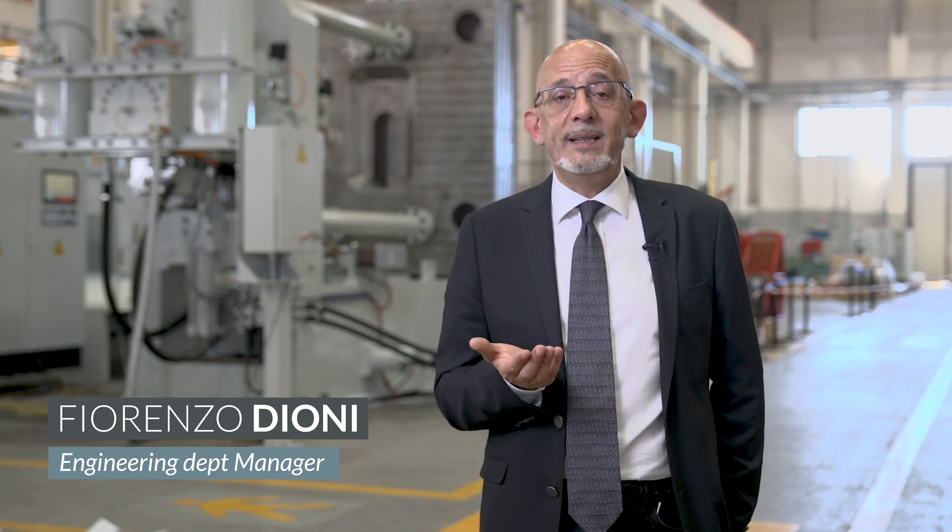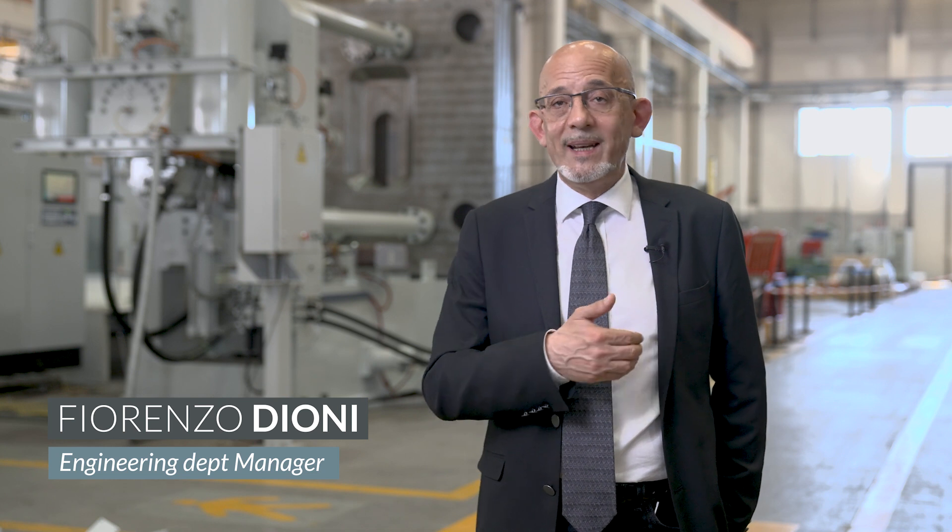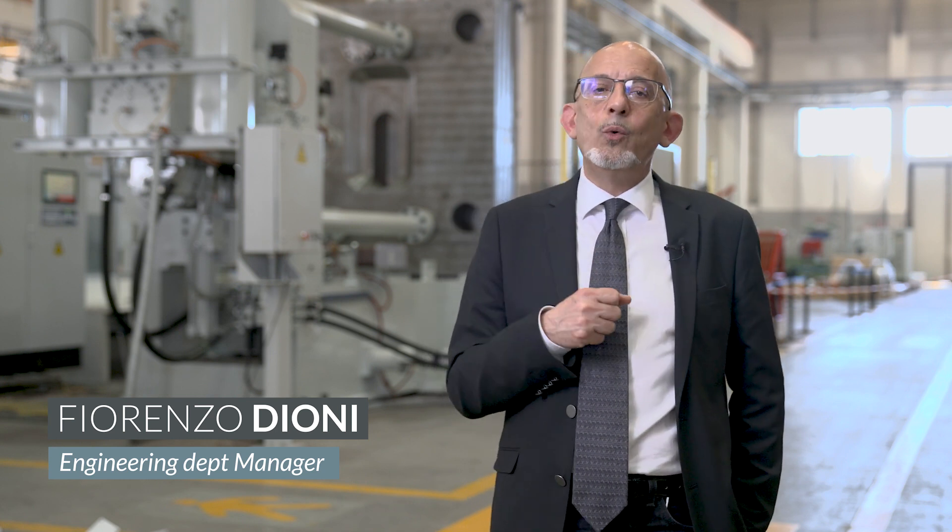As a result of the regeneration of the hydraulic fluid, we use a relatively limited amount of pressure and flow from the second stage accumulator, greatly reducing the pressure drop and consequently having full power and high speed when needed. All this gives a clear indication of why those 5Ss make up the name of the unit, which has become the true heart of the Gigapress. That independent motor, called DCP or Drive Control Pump, will be equipped with the 5S injection on the new NEO series, equipped with this new over-the-edge drive control system developed by IDRA.